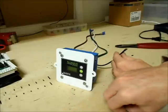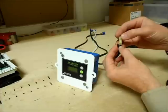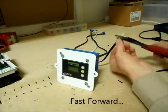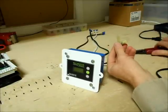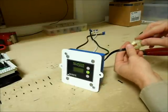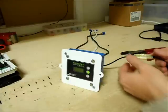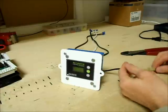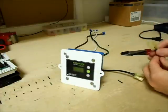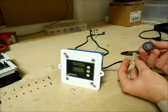Do the same thing on the other side. This can be done with pliers if that's all you have — just make sure you get a good crimp. Once those are done, the two ends go back together very simply and you have created a splice in your wire, which means you can feed one end through the universal bushing, then put the wires back together and you have a nice tight connection through the wall of your incubator.